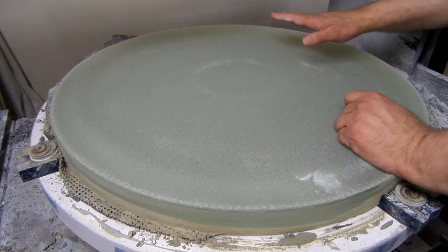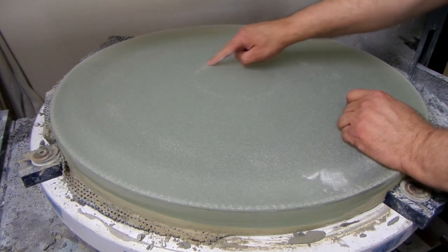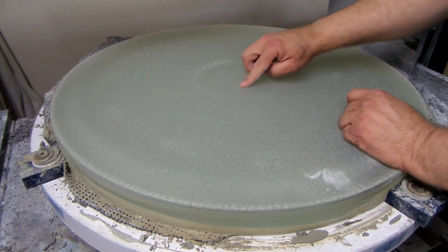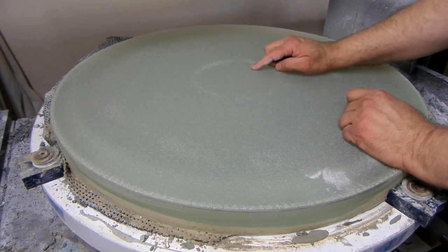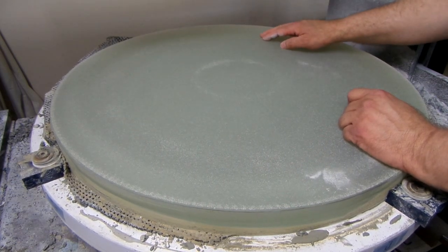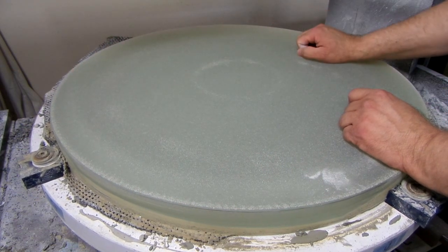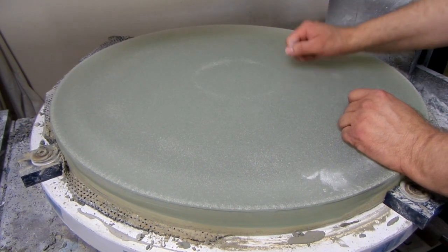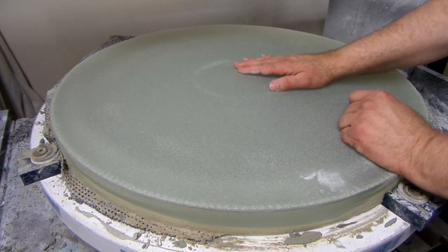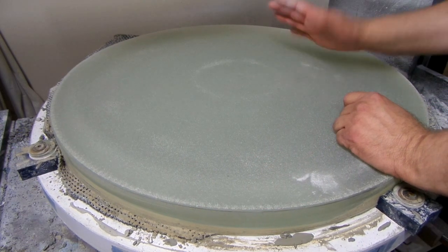If you look at this, it's actually pretty flat, except for a few spots. There's a ring right here that you can see by its rougher nature — what's left after the 24 abrasive — where the smoother part looks like the number 40 abrasive. There's a little bit of roughness out around the 60 or 70 percent zone, and the very edge of the mirror hasn't been touched yet — I can still see marks from the diamond grinder. So I'm going to work another session of number 40 abrasive with the steel tool on the fixed post machine. I want to show you how I do that.